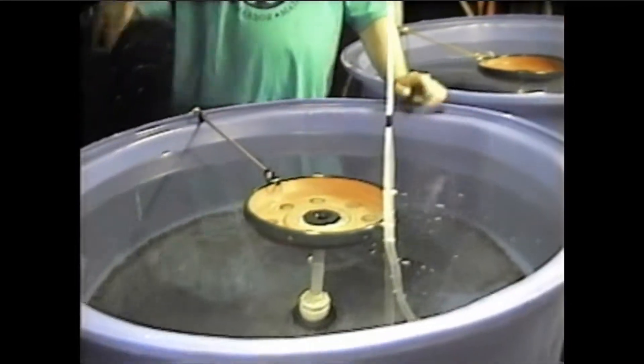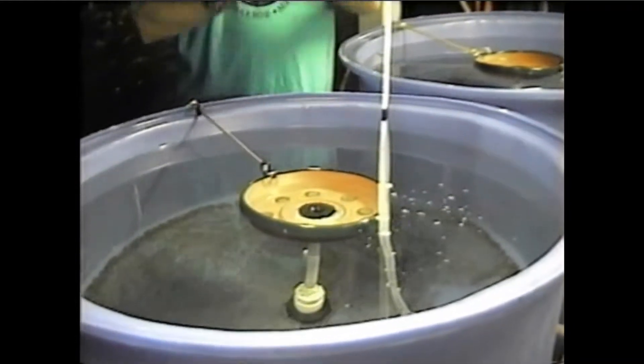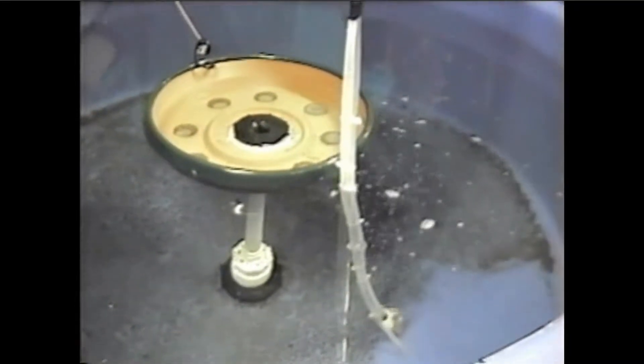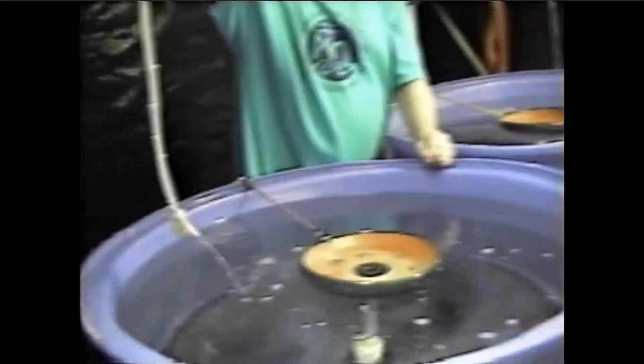This blue tank is our larval tank. See that pipe coming down from the ceiling — that's upstairs holding water. The water comes into the tank upstairs, and we've got a heating coil and a furnace up there. In wintertime we can heat the water up to 45 degrees — 45 would be ideal for raising urchin through the larval and metamorphic stage. In winter, the seawater is going to be 32-35 degrees, so we've got a heating coil that'll jack it up to 45 degrees.